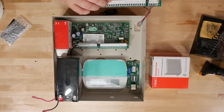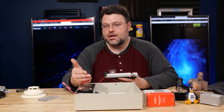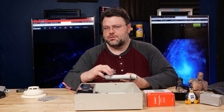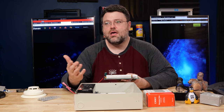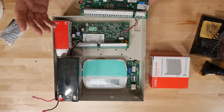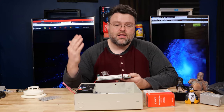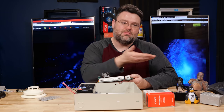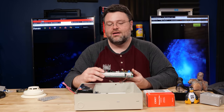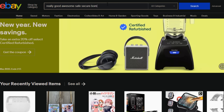Because there's no encryption and nothing DSC has done to lock it down on the hardwired side, I feel it's mostly okay. It is possible to use wireless sensors, and you should check out Ryan's video on that — you can see all the information from sensors. But if your neighbors or someone in an unmarked van across the street can monitor your wireless sensors, how big a deal is that? It doesn't mean they have access to your network. Some older keypads you'd want to avoid since they give you no zone naming control. I love renaming zones — kitchen, crawlspace, garage, panic room, bathroom one, bathroom two.